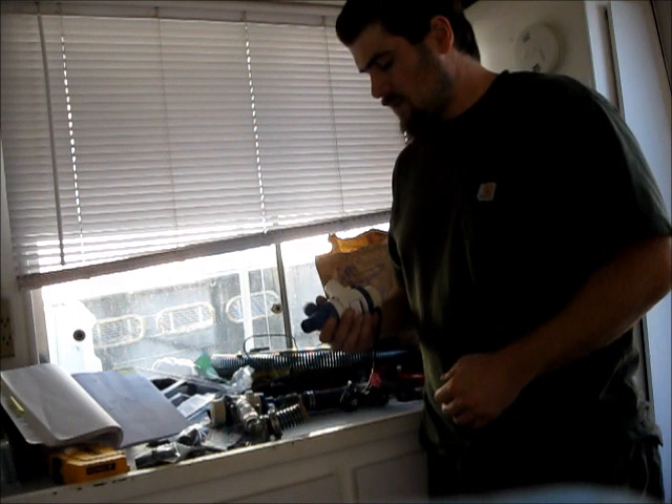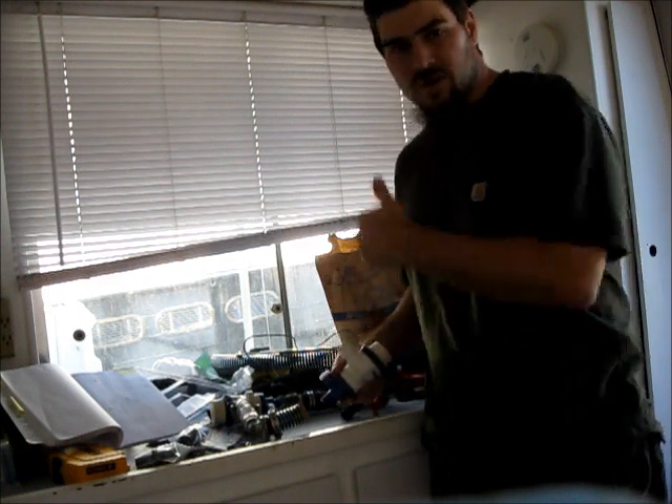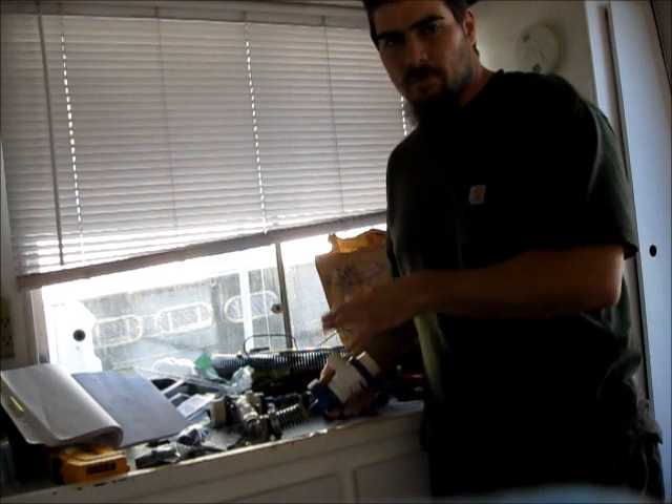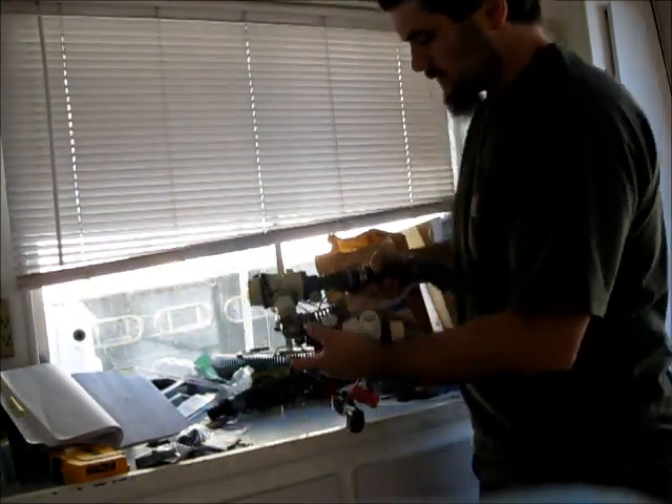These are live well pumps and they're not designed for high pressure, so two of them in series will give me twice the pressure but the same amount of flow. And so what you can see here is this whole part — these are the electric pumps.